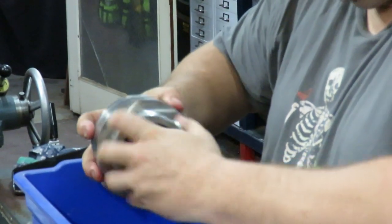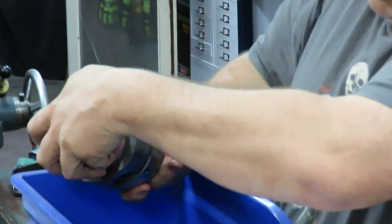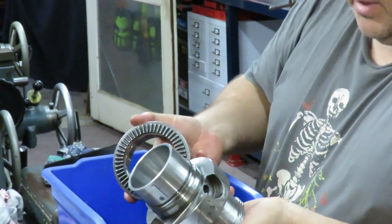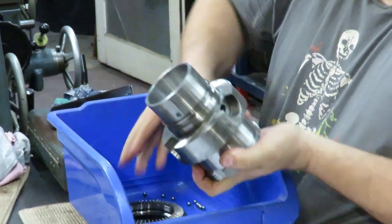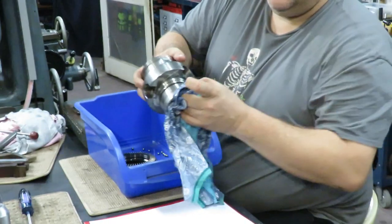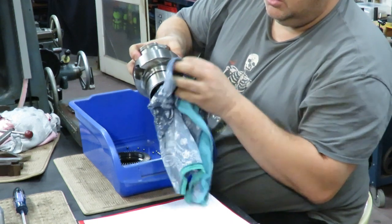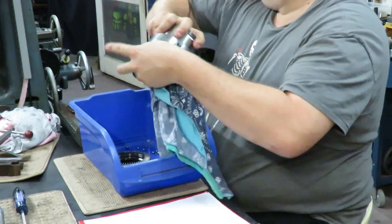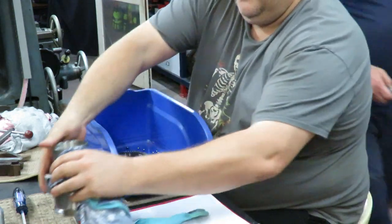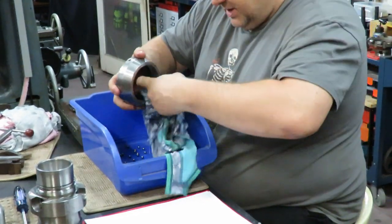There's a grub screw in the side that holds the balls in place and as you can see they're all merrily falling out. Once we get her apart we can see the bits for inspection for wear. We've got a ball race machined in the surface here that gives us the ID of the balls, and then we've got a ball race on this side which is the OD of the ball race, and then we've got the balls themselves.